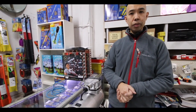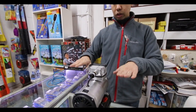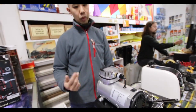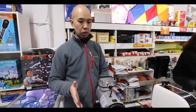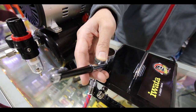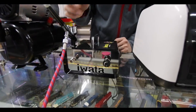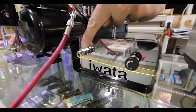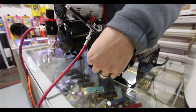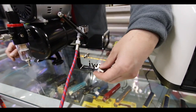It's not particularly loud. Airbrush compressors are diaphragm type, which means there's a flap that just moves up and down — it doesn't actually use a piston. This one's a little bit easier to live with too, because when it switches off you won't hear anything at all. Moving on to the Ninja — it's got a similar quarter inch fitting on it, but if you want to use your own hose you can disconnect this adapter and it comes down to a standard eighth inch.